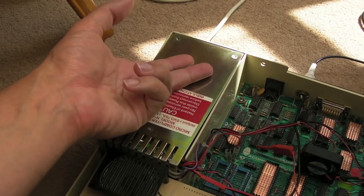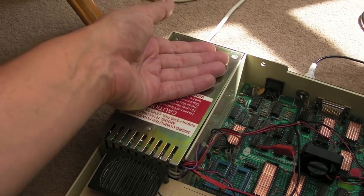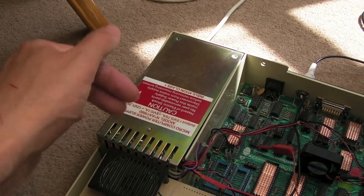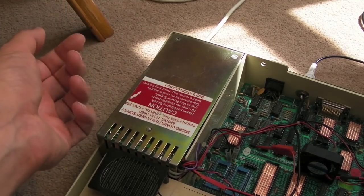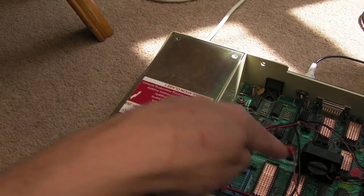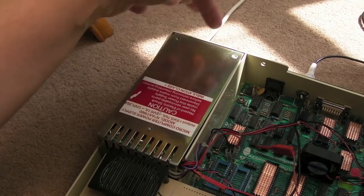And of course, there's a good argument to suggest that the power supply is your biggest source of heat problems within this system. Just feeling the top of that there, it's absolutely red hot. It's incredibly hot. So a fan somewhere within the power supply would be a super good idea. It's just a question of where you fit that. If you've got smaller caps like I have down in this section here, there may be room to fit something within here, facing one way or the other to either suck air in or out. It's just a question of how it gets out.